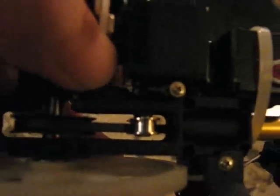Make sure it's nice and taut all the way down here. Make sure all these screws are still nice and taut down here, right where you need them set. Check the belt for play. Make sure there's not too much play. If it's slipping off the tooth, you want to check there, and right in there. Make sure that it's not slipped off those gears right there.